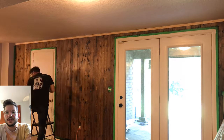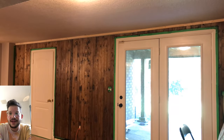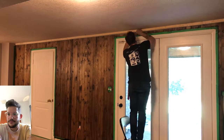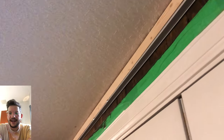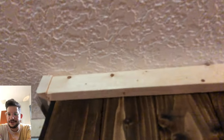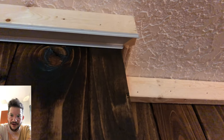Here is the aluminum channel we are using — this is just an extruded aluminum channel commonly available on Amazon. Here are the clips that screw into the wood, the little plastic end caps for where you start and finish, and the screws all came in the kit. I'm going to show you how this is going to slot and screw nicely into that channel, because the channel is about three-quarters of an inch wide — same as our 1x2 that we tacked around the whole upper perimeter. We're screwing that in, and this not only provides a nice spot for our custom lighting but also closes up the gap between the wood paneling and the ceiling. Working around the whole room screwing in those little clips that hold the aluminum channel, adding miter cuts at the corners.